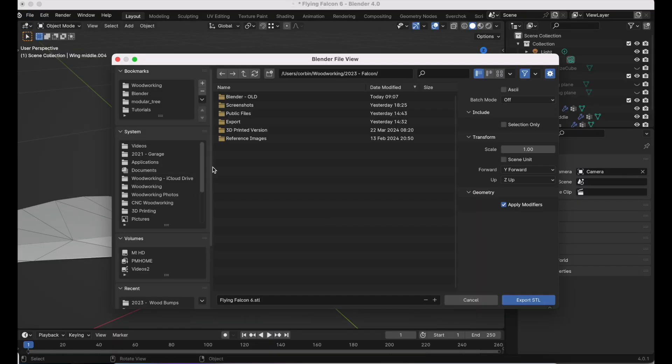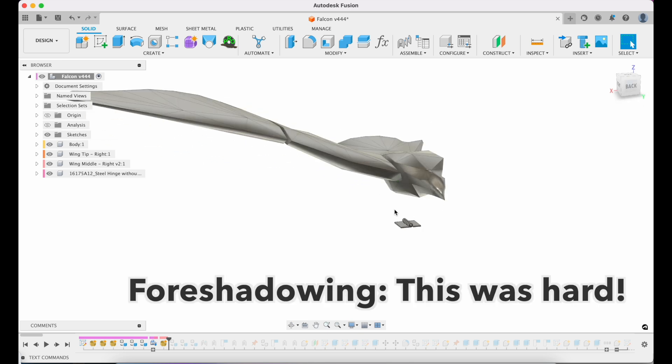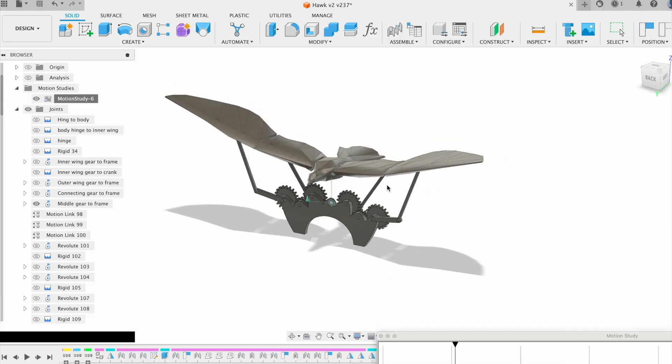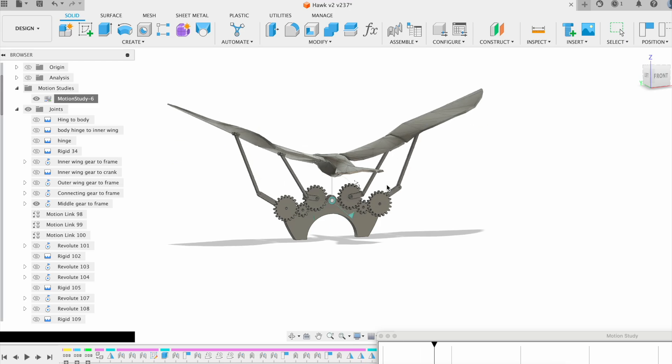I exported the model — each of the pieces as an STL — and then I could import the STL into Fusion 360 to create all my mechanisms. One of the first things I had to figure out was how to connect each of the wing pieces together and have them move. I decided to use regular metal hinges, and I figured I could cut some type of slot and insert them in the wood and glue them in place. I found the model on McMaster-Carr because you can directly import it into Fusion and use it, and that worked pretty well. Once all the wings moved in the model, I had to figure out how to make them all look realistic so the bird was sort of flying. One of the most difficult parts was figuring out where to place all my hinges and all my rods and shafts to make everything move in the particular animation I wanted.